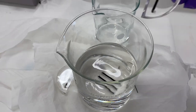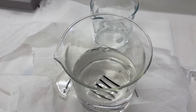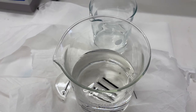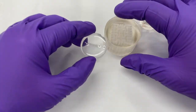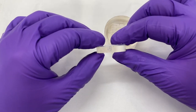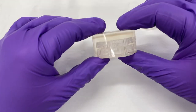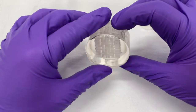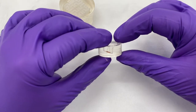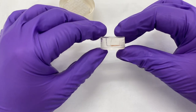Or maybe it's the end of the day and you're just lazy — you can throw it in acetone, leave it overnight, and the next morning most of it will be dissolved and you just need to push the rest out. Easy peasy. And there you have them: the frequently asked questions about this method. It's really easy and simple — you can practically do it at home with stuff from Amazon. I hope you enjoyed and I hope you are making microfluidics, or that you will in the future because it's very easy, nice and doable. See you next time.